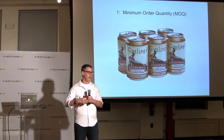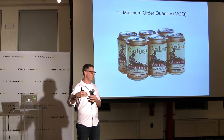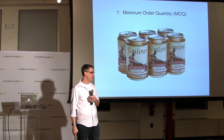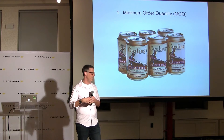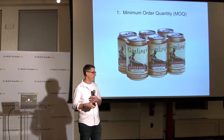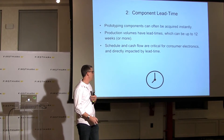As it relates to electrical components, when you're building in volume, you're probably going to buy reels of capacitors in 5,000 units — that's just how many they put in a reel. But if you're only building 3,000 parts of your product, you still have to account for the other 2,000. That's one thing that bites a lot of companies.